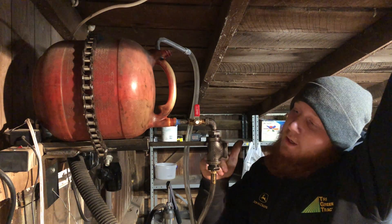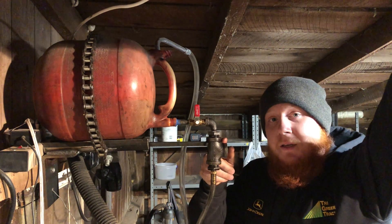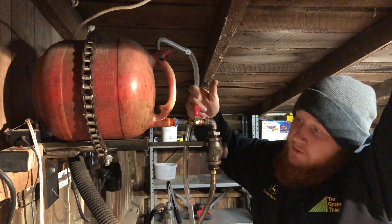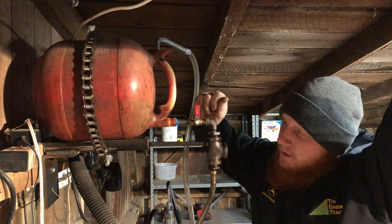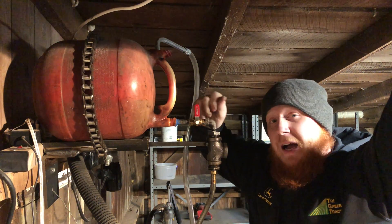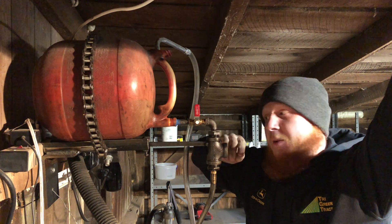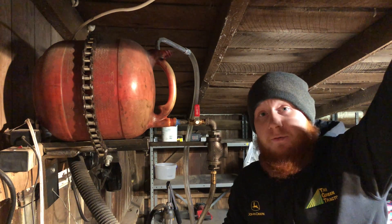My first recommendation was to turn down my oil feed, so I marked a reference line of where it was currently at and turned it down to just a drip. Actually I went just a little higher than a drip, so it was like drip drip, then like a steady stream — and it worked perfect.